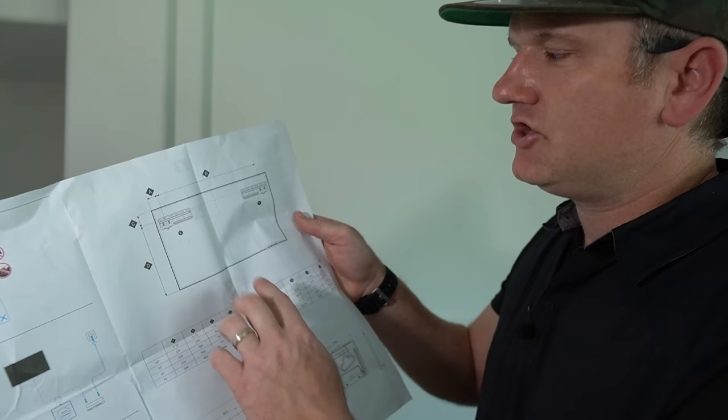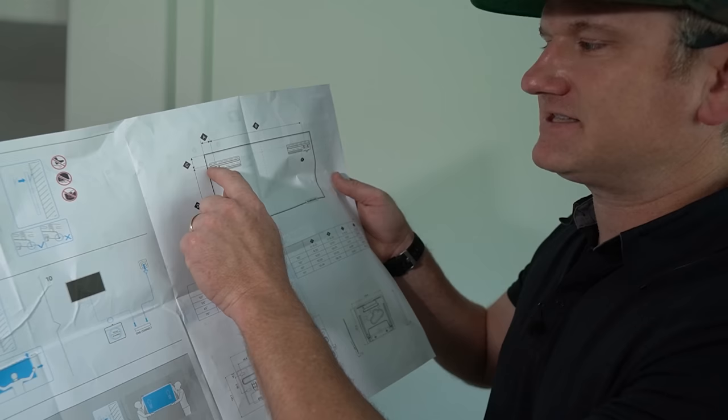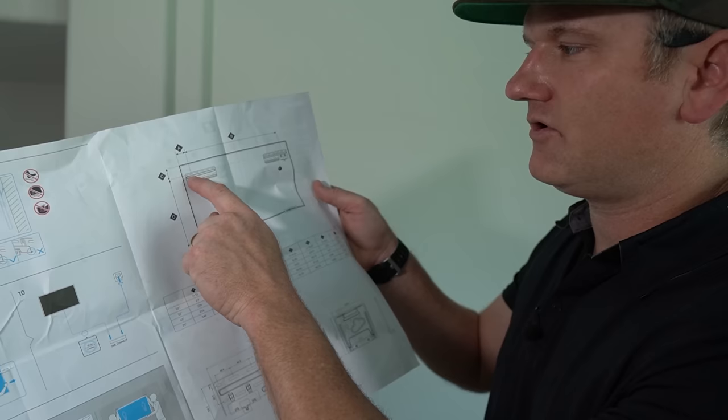We're going to have to do a little math. I'll go over it quickly, but you'll have to use the guide to figure out where the bottom of your TV is, measure up, and that distance — called D — is where the top row of holes will sit on the wall. If you know where that top row of holes is relative to the bottom and on the wall, the TV should line up to where you want it. It's a bit confusing, but you're going to have to do the math if you're installing this yourself.